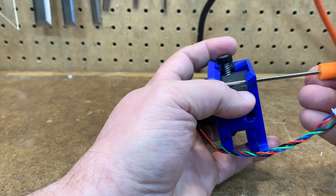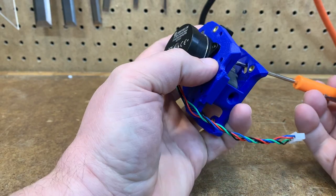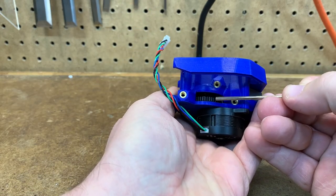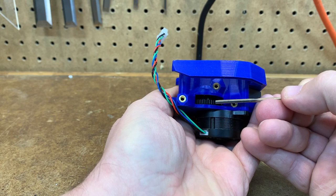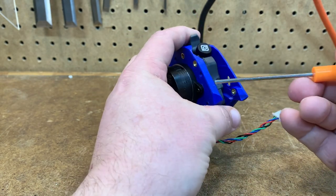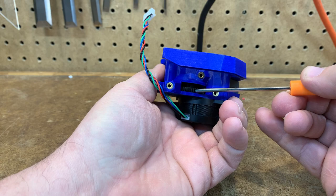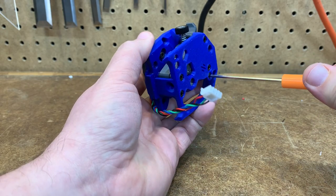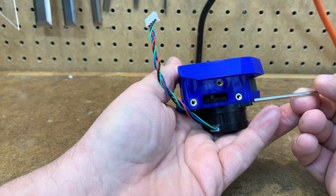If you get a little bit more — I'm going to back it off a little bit more here — now I should be able to see some of that motion. That's not terrible; it's not going to be as precise, but I doubt that you're going to be able to see that in your prints. That's perfectly okay. But once you get that tightened down with that screw on the slot, once you check it and you can hear or feel just a little bit of play, tighten the screw in the slot down, tighten your pivot screw down, recheck, and if everything's still good, you're good to go.